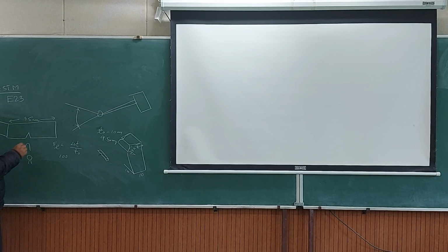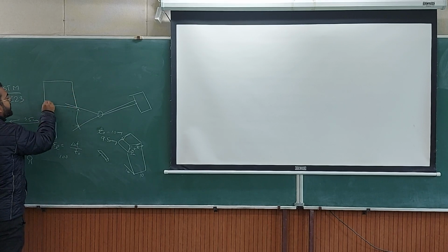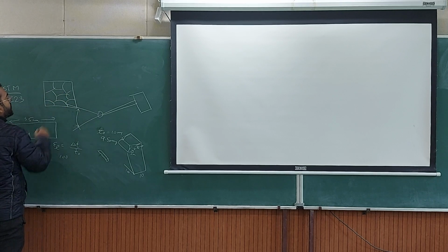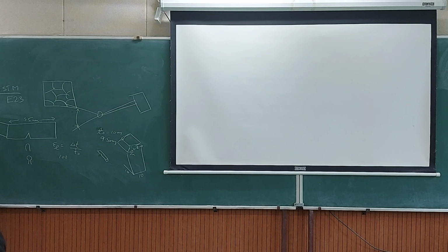And so what happens is that, suppose this is a polycrystalline material, so you have a lot of grains in it. And each of the grains, how are they different? Why do we have a grain boundary? Because the orientation of each grain is different. So in each grain you will have the 100 plane in a different direction.